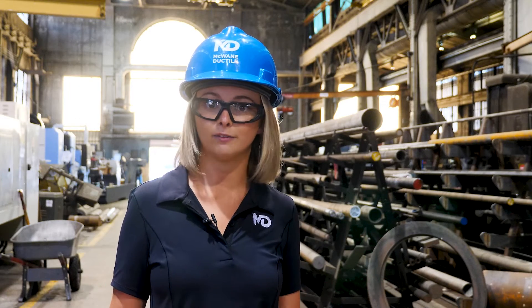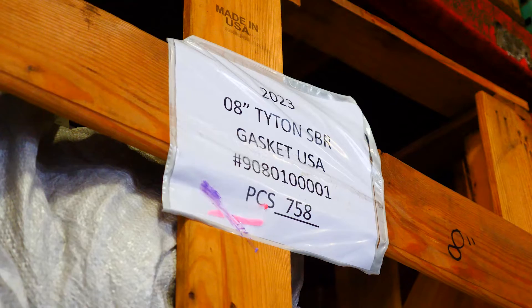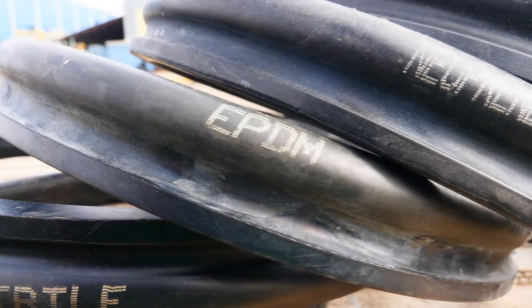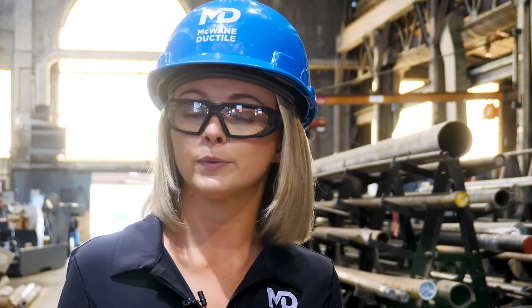SBR is widely available. We use it everywhere for industrial parts, tires, toys, athletic equipment, and thousands of other products. High tensile and impact strength make it resistant to tearing and cracks. It's intended for use in normal temperatures up to 150 degrees Fahrenheit. For pipelines subject to higher temperatures, hydrocarbon oils, solvents, or other challenging conditions, you must invest in a specialty gasket to ensure a leak-free and safe design.